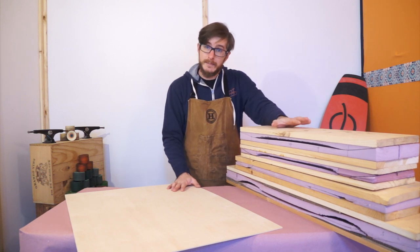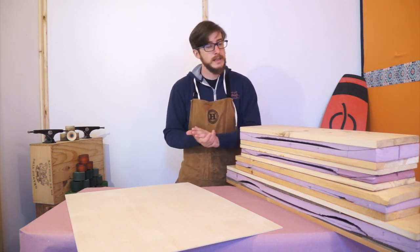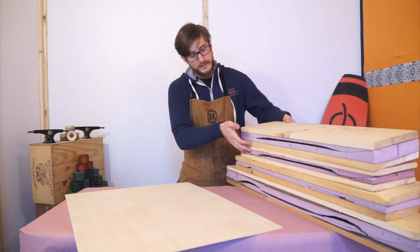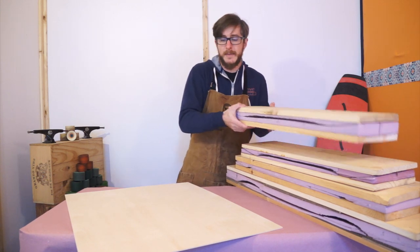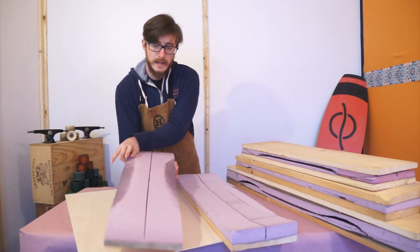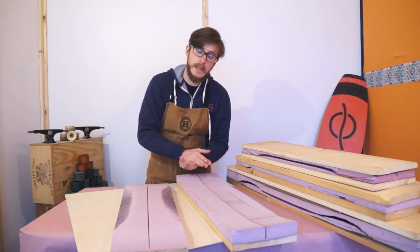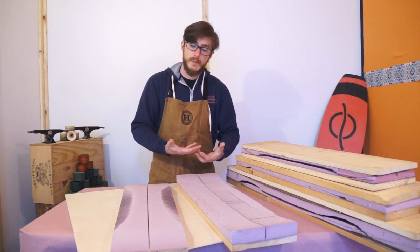They're a style of mold called a dim press. I didn't make this up — you can find them online. They've been used in the amateur mid-level board building community for a very long time and they're made out of pine and insulation foam. A dim press has some upsides and some downsides. Essentially we have a mold with a male and female half and we are going to be compressing them together with all of our sheets of wood in the middle. When the glue between those sheets cures, we take it out of the mold and all the curves will be locked into place.